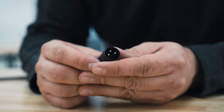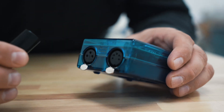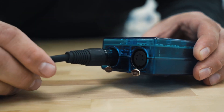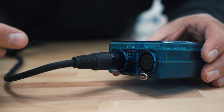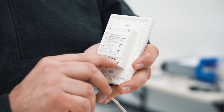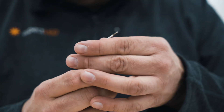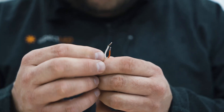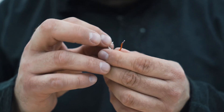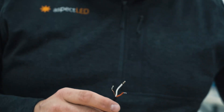This can be connected into various different DMX controlling devices. As an example, there's a standalone player — you would just plug in here and control it with compatible software. If you don't have that or want to use our in-wall controller, it has DMX connectors on the back. You just take that cable and cut it off — it gives you three wires. The red is your DMX negative, the white is the DMX positive, and the bare wire is the DMX ground. Those go to the correct ports.